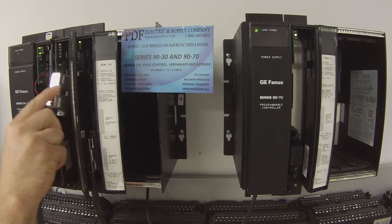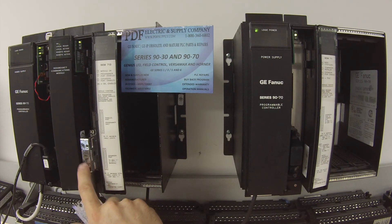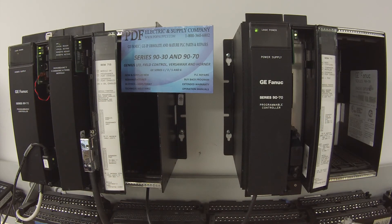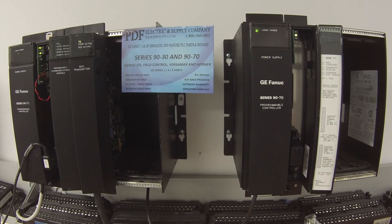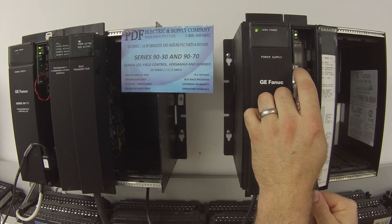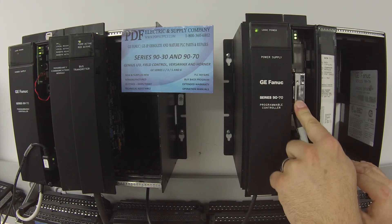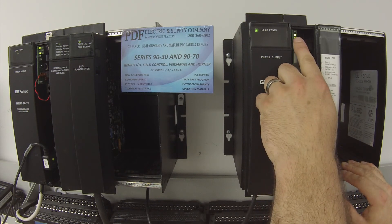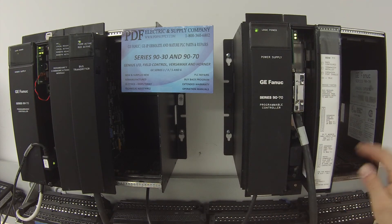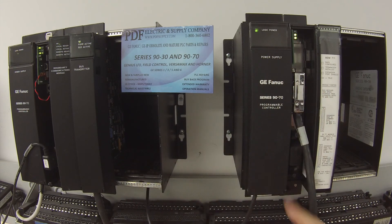Next, I'm going to take this end back off the RCM711. It's still connected to the expansion port on the BEM713, and I'm going to take that cable and connect it from transmitter to receiver — connecting it to the expansion port in on the BEM711. Again, be patient; this is a cable you don't want to bend any pins with. Now that it's on there securely, I get Expansion Port Enabled again. The bottom LED shows Termination Installed. I know there's port activity between these two modules — the 713 is sending a signal to the 711 and it's receiving it. They're all talking. I'm satisfied with that test.